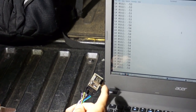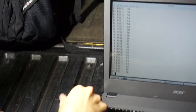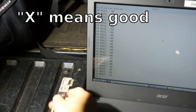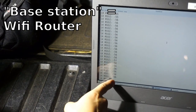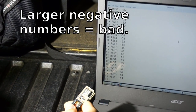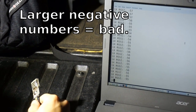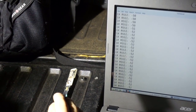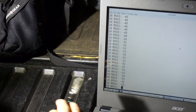So here I have the ESP module connected up by serial to my laptop and I'm just watching it. This module is reporting whether or not a packet is sent from this module to that TP-Link up there and back. It will put a little X there, which means this thing is currently communicating to the base station. Additionally, it shows the received power — the RSSI — from the base station. One interesting thing you can already see is that very small changes can cause significant changes in the RSSI. So even from here, 44 to 52, 53, 54 — that's a significant amount of power difference over just a few inches.